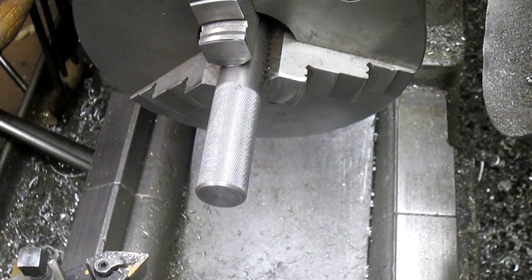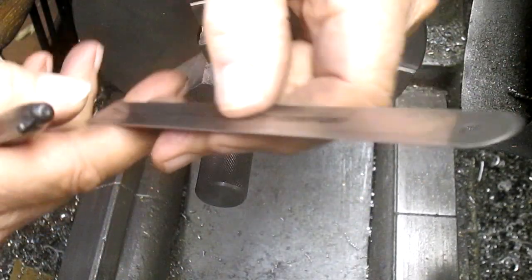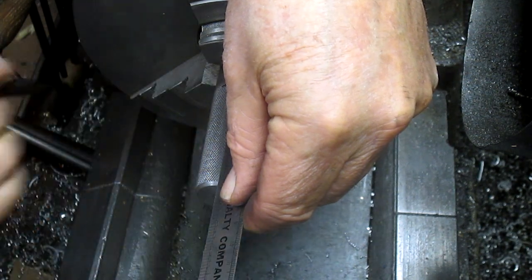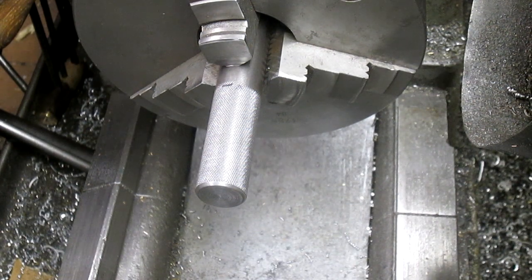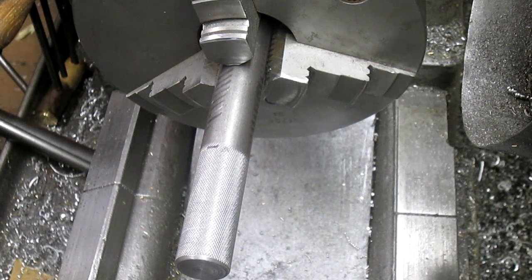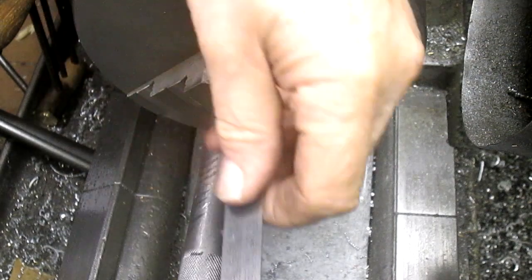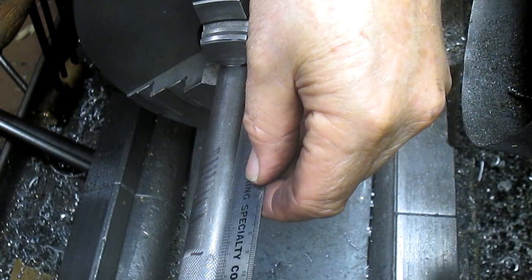Yeah, nice. Okay, good start. Now, 2.5 inches, yes. Two and 1.5 inches takes us right to pretty much the edge here. Now, we're gonna spin this around. But since we have the knurling on it, we're going to put some aluminum. And so let's see what this next part is. It's 3.5 inches. So let's come out to 3.5 inches. There's 3.5 right there.